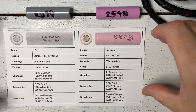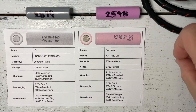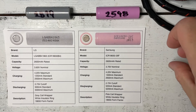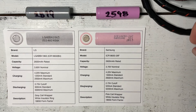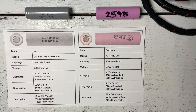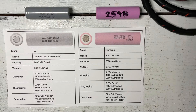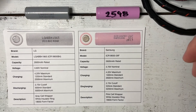All you need to understand for the second basic rule is there are quite a few differences, even though they're very small, which will affect the operation of a battery. To make it as efficient as possible, buy all the same cells for that particular battery. Plan ahead — if you need a hundred cells for a build, buy them all at the same time and all the same type. I buy all these LG cells because they're higher than their rated capacity and they're rated really well. Basic rule number two: plan ahead, always put the same cell in the battery, and never mix and match.